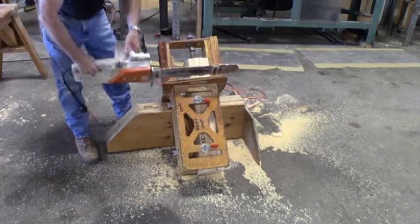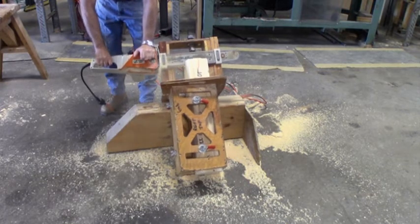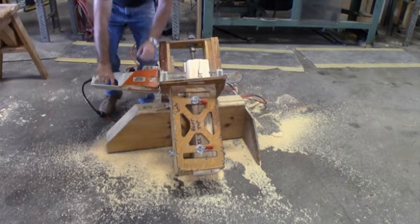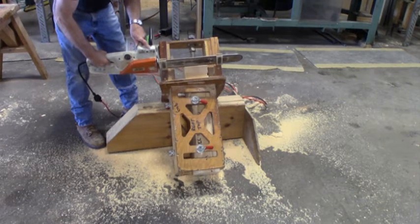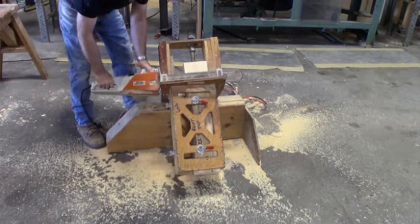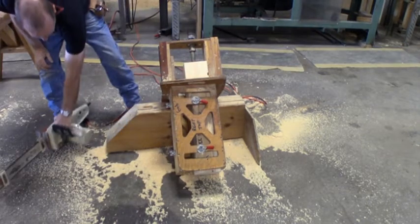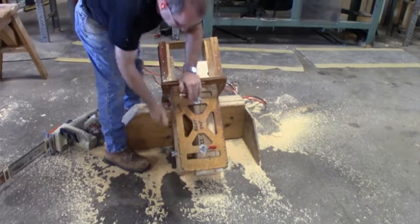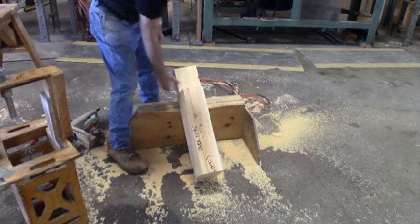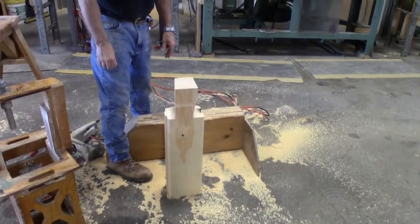In this particular example, one of our experts is crafting a 6x8 D-shaped log with a dovetail corner. The log is secured into the custom made jig, then utilizing a chainsaw, the necessary cuts are made. The initial cut removes the majority of the excess material and a second pass follows in order to perfect the pattern. This process ensures a quality, detailed and consistent cut on each and every corner. The dovetail corner assembly is often utilized in creating high quality furniture and cabinetry pieces. It's known for its incredible strength and beauty and is our second most popular corner style. Once the cuts are completed, the jig is then removed and the log is ready for the next step in the pre-cutting process.